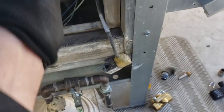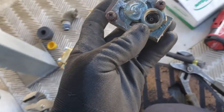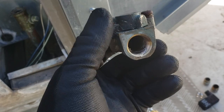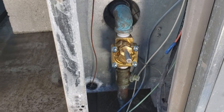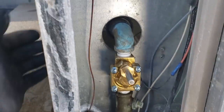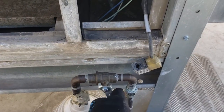In order to get this off we had to pull it apart in pieces because of the way it turned inside - it was hitting the wall, so we had to pull the stem apart. It's interesting because the valve has basically exploded internally - you can see springs and stuff. I was not able to rebuild the valve because I couldn't get the screws out, they were breaking on me. But it really wasn't that hard to change anyway - just pulled it out. Luckily there's a union right on that side, and everything unthreaded easily since they used Teflon.